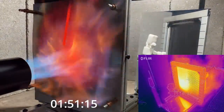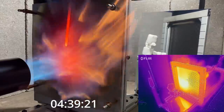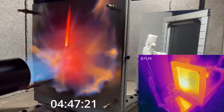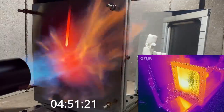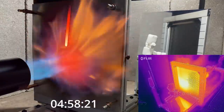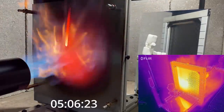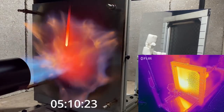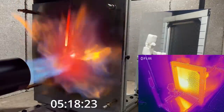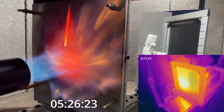As the test progresses, the temps do climb at the Marshmallow Man but they stabilize after a while. We didn't run the test for the full 15 minutes because you can get an idea pretty quickly what's going to happen — after about five or six minutes, everything stabilizes at about 120 to 125°F at the Marshmallow Man. Keep in mind there would still be a half-inch thick honeycomb sandwich panel behind the blanket, and that honeycomb core traps a nice pocket of air that acts as further insulation, so we'd expect even cooler temperatures in the cabin. As this test stands, it's a pass — fire doesn't come through the firewall heat shield, and not too much heat gets into the cabin. This is a working combination, and it's actually pretty popular in composite kit aircraft — this is what I used on my Cozy.